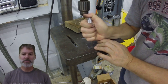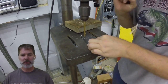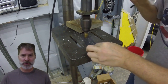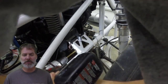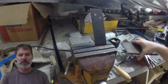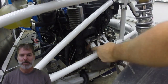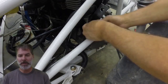One thing I did pay attention to: I looked at the old shifter to find where the center ball is for the movement of the shifter, and I made sure I kept that ball at the same location when I switched to the new shifter. So it doesn't sit flush on the plate — it's actually back an inch or so from the front of the plate — but that is the spot where it was correctly aligned. So I'm not reaching extra far to grab the new shifter. It'll be basically at the same location, just a little bit lower.